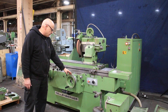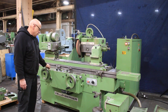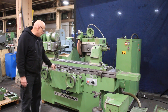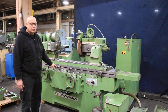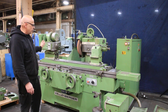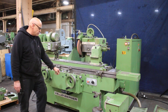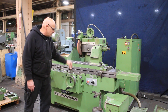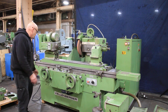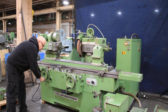You also have the ability to stop the feed or wrap it to feed down to your work piece. In the plunge grinding mode, this is your mode selector switch up here and you've got different modes: basically plunge grinding, hand grinding, and traverse grinding with feeding on the left, feeding on the right, or feeding on both sides. In the center position you free up the hand wheel to set up your work piece. You also have a clutch with coarse and fine feed for the hand wheel, and coarse and very fine for the table.